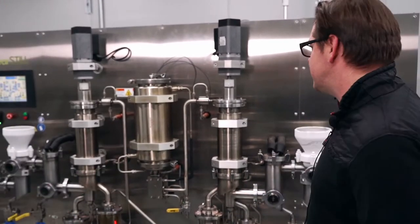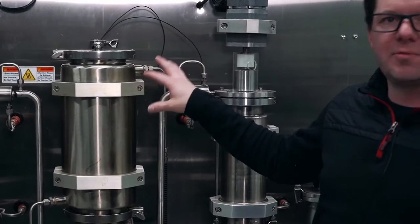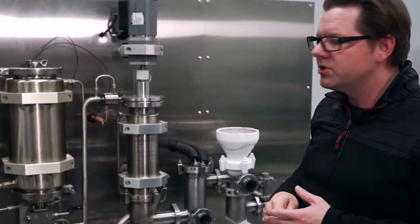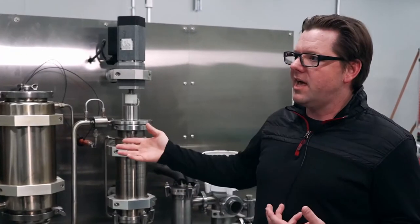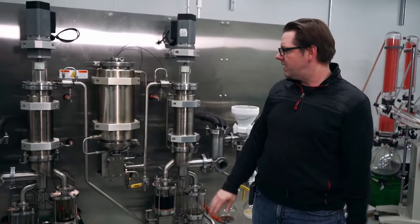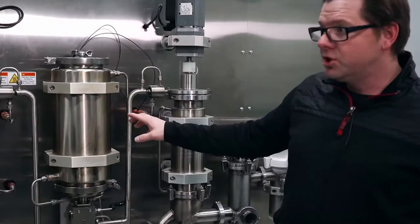Let's go through the whole path first. You fill the reservoir — typically you can put seven or eight liters in there. It's all 316 stainless steel, and all the seals are either PTFE or food-grade high-temperature silicone rubber. There's a sensor in the reservoir to tell you how much is left, visible on the HMI panel. This is a gear pump, and everything is traced with a hot liquid — the gear pump moves the oil to be distilled.